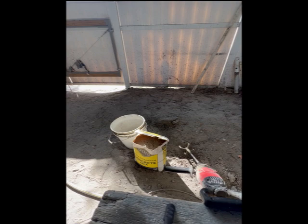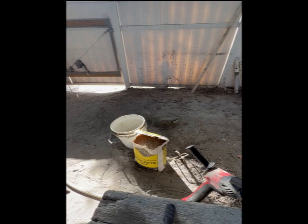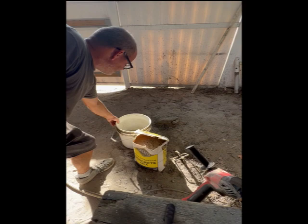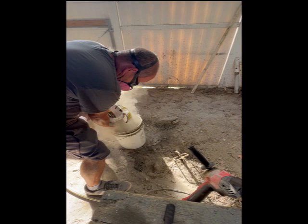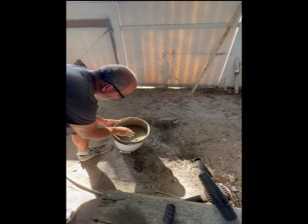This is how we mix up the concrete — easiest way to do it. It's a low-speed drill with a paddle bit mixing on the end of it, from Harbor Freight. A 60-pound bag of concrete in a 5-gallon bucket with about a quarter bottle of water. We want our mix at the right thickness — not too thick and not too thin.